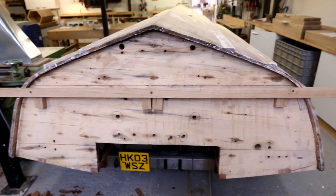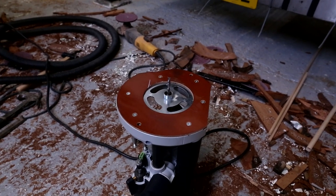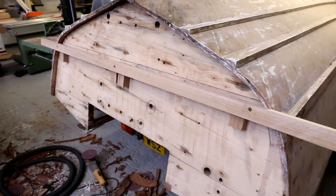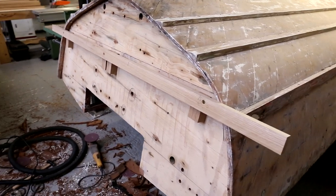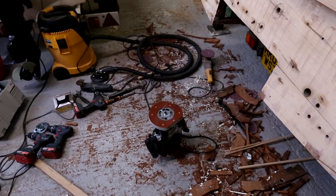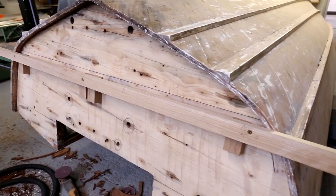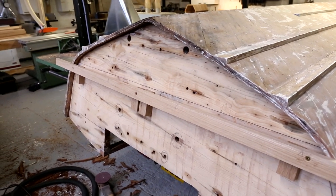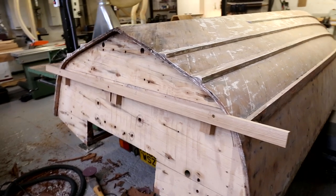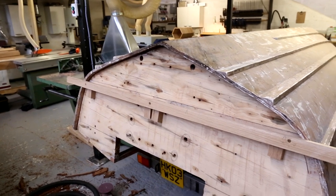So what I'm planning to do next, and what I'm set up for now, is to route a small channel in there. Just going to use a 1/4 inch router bit and a small guide bush, just a little bit bigger than the router. And then I've set this piece of wood up along here. So this is screwed to the transom, and it's positioned to account for the guide bush and the cutter that's on the router. That's going to cut me a channel right down the middle of that line basically. So I'm going to mill out a 1/4 inch channel in that, and then I shall glue a splint of new wood back into that piece